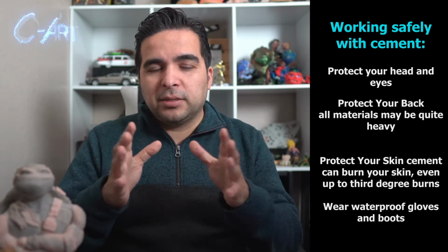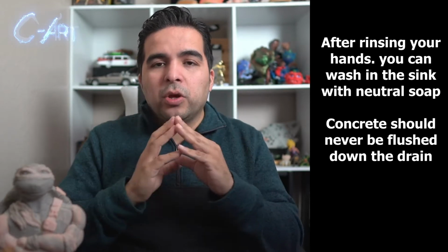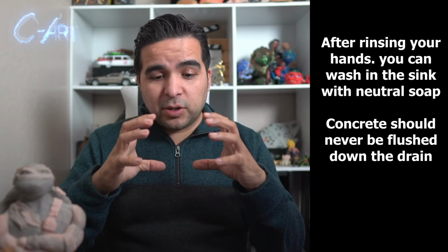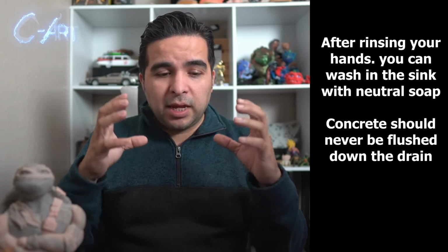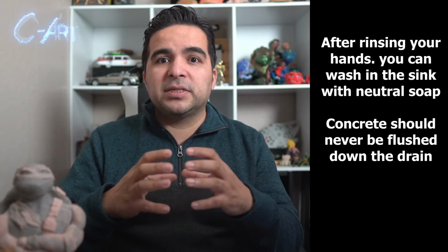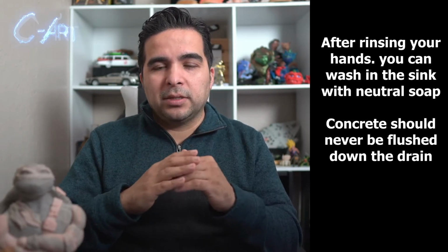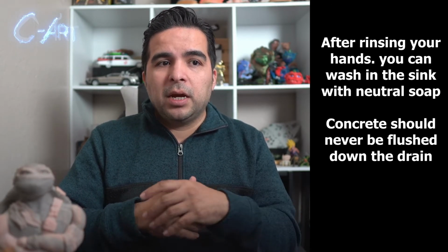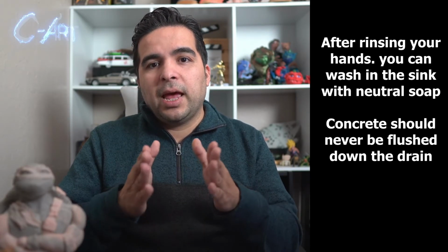That's a huge mistake. Never dump anything inside your house, nothing in your sink. You don't want the cement to go into your pipes because you're gonna create a complete ball of cement that is gonna clog your drain, and you're gonna have to fix it, and they have to open the floor, and you don't want a nightmare like that. So the best thing that I recommend when you're working with cement, first of all, if you're not sure, is to work in small quantities.